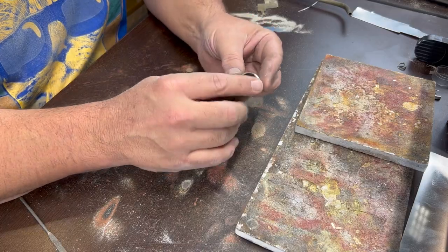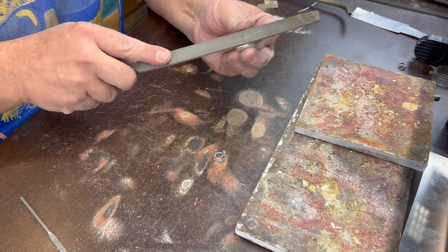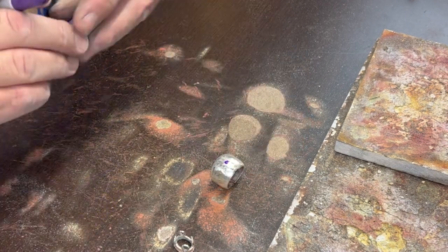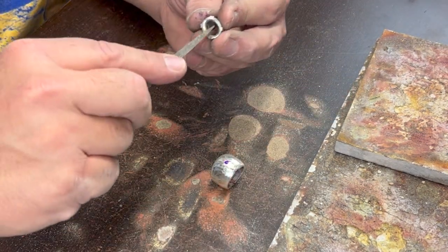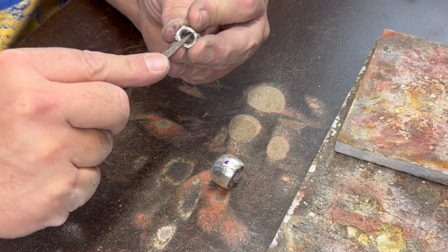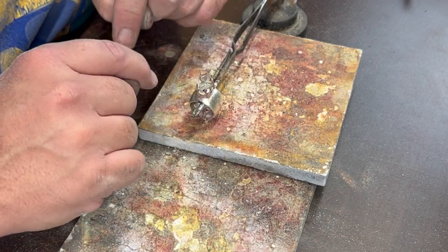Okay, I shaped this a little more, and I filed it and cleaned it up, and I also neatened up the edges like this with the master file. I think if I put it right about there, that'll be okay. One other thing I did is I tapered this inwards a little bit in this direction so that the edges would sit down nicely on the little dome shape. Make sure it looks straight this way, as well as having about the same distance from either side.